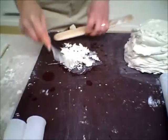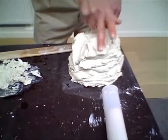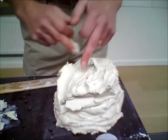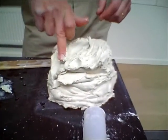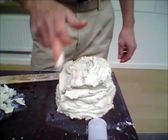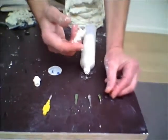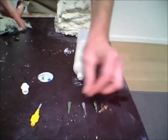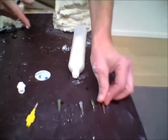I'll keep working that until I start getting a lump of clay that is that sort of consistency — it would be too soft to throw with, but it's certainly not runny slip at all. What I'm looking for is just a bit of moisture on the surface, because the clay is going to extrude and each extrusion has to stick together, and that little bit of moisture makes sure that you get a good bond between the layers. It also has to be soft enough to go through the little nibs — why I can't say exactly what the consistency is — if you're working very fine you need a slightly softer clay to push through than if you're working slightly bigger and with a bigger nozzle.